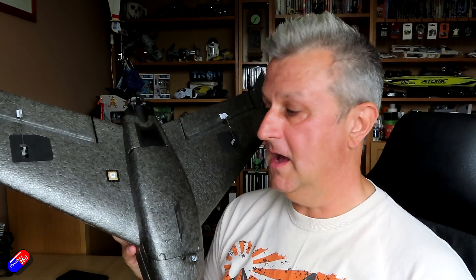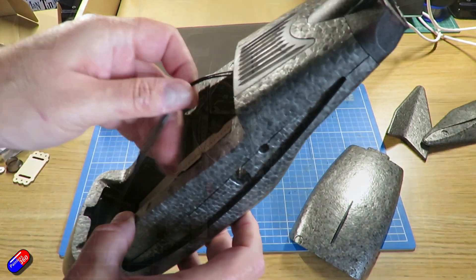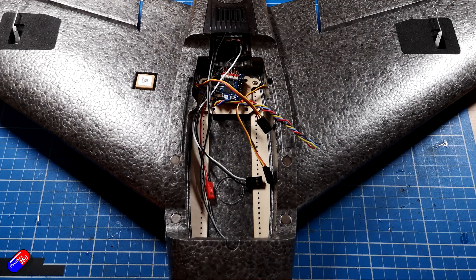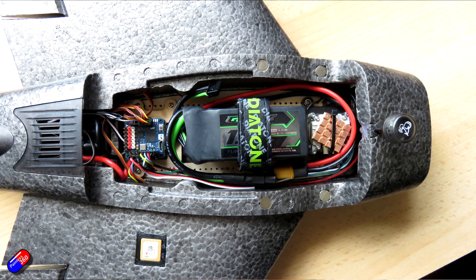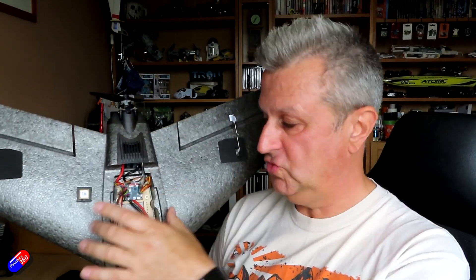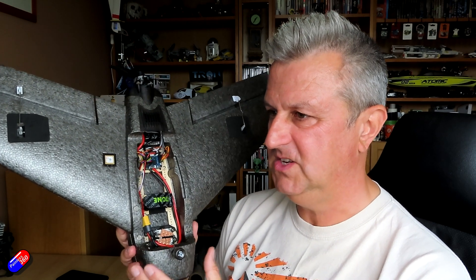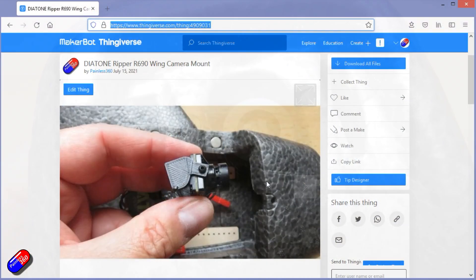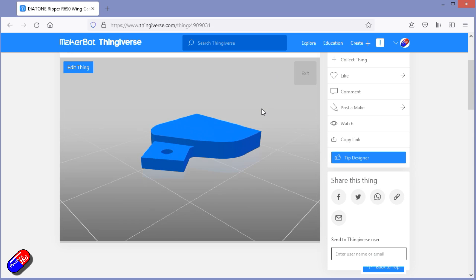Hopefully after watching this video you'll know how to set yours up a bit more. The space inside looks huge when you first get it but disappears really quickly — with a flight controller at the back, a DJI air unit at the front, and the cable not being long enough to put it anywhere else, there isn't as much room for the battery as you think. It would have made sense for the body to be a smidgen wider so you could mount the battery laterally. I've created a camera mount on Thingiverse to mount a 19×19mm camera in the nose with a little wiggle room for angle adjustment.